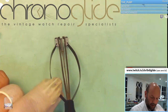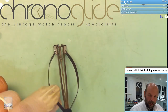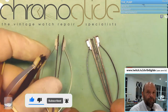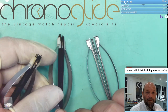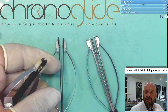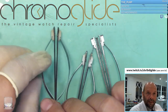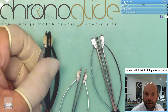This one here is quite wide, and it's got a small indentation in the middle, so it really grips the pivot so you can take out the hands. But here you can see it's slightly different — there's two on one side and one on the other. This is perfect to take off wheels with an uneven amount of spokes, so one side goes over the spoke. And this one is for taking off wheels with an even amount of spokes.